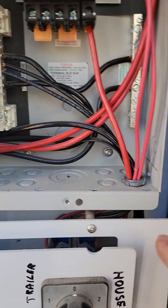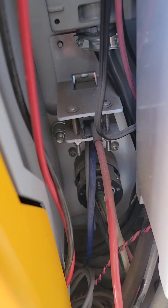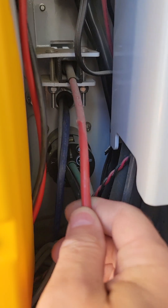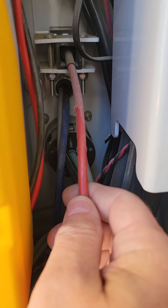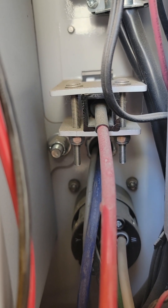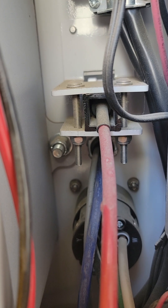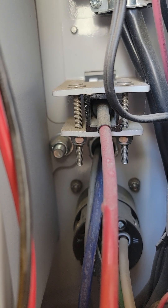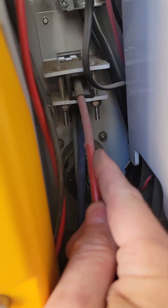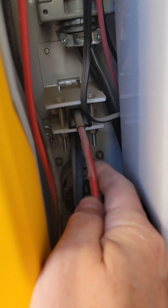This main line comes down, goes through the bottom of the cabinet, and comes over here — that's the same red line connected just above where the generator would normally plug in. I've never really had a situation where the wire on the inside was loose; it's usually successfully snapped in. But inside that little square adapter there is a single-pole Anderson connector, very similar to the Anderson connector the batteries use.